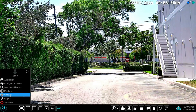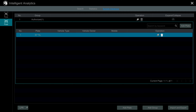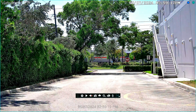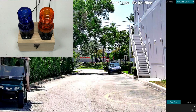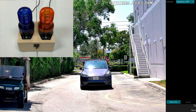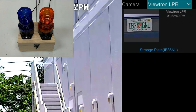Next, we're going to remove my license plate from the authorized list. I'll go back into the main settings on the NVR, select LPR again, and go into the license plate database. I'm going to delete that entry so there are no plates authorized now, and save those settings. Then I'll close the configuration screen and go back to the live view. I'm going to drive up to the license plate detection zone again. This time, when my license plate is detected, it's no longer in the authorized list, so it will be identified as a strange plate and trigger alarm relay output three, lighting up the orange light.